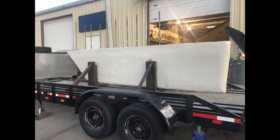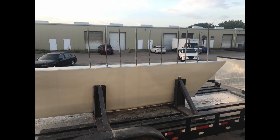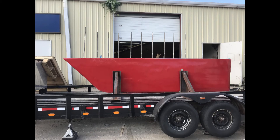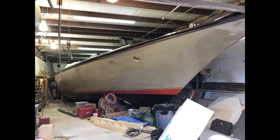So it's all primed now, and then I will paint it. I'll paint it bright red first, because when I get to the coast and put it on the boat, I'll paint it black to match the rest of the boat. That black paint is a copper-based paint that leaches off over time, so that when barnacles and things attach to the boat, they come off as the paint leaches off. So you've got black paint with red underneath it — when you see the red under your boat, you know your black paint is due to be replaced, and it's time to pull the boat out of the water, clean it, and repaint the keel and the bottom sides.